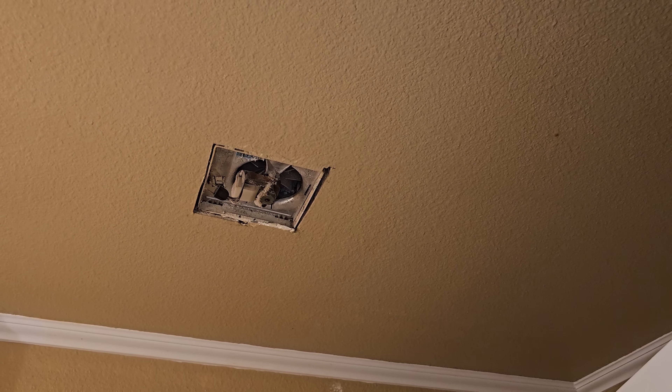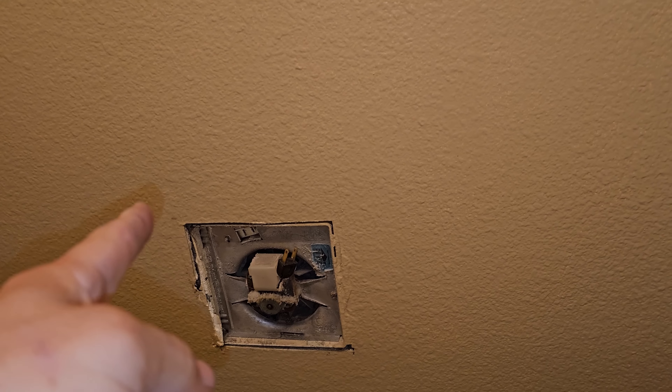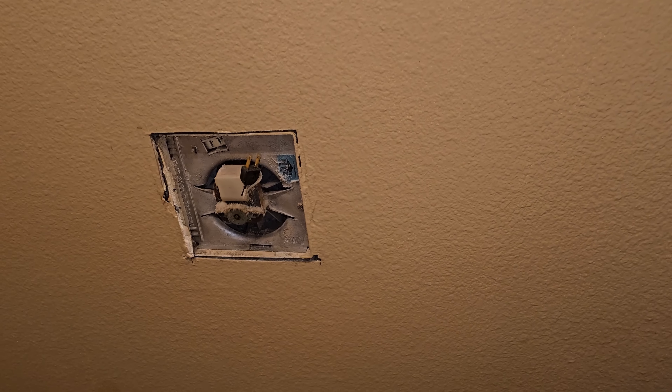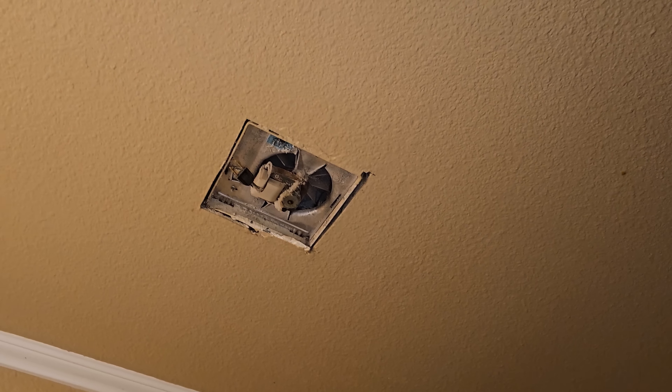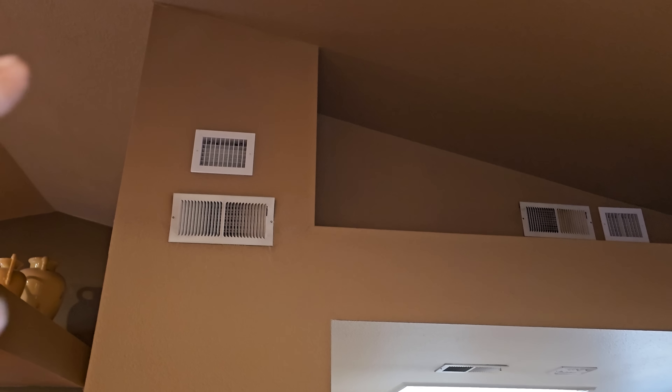Part of my project — we're putting in better bathroom fans, so I'm about to retrofit this one to the bigger fan that has a light and a built-in damper to help with air leakage. I've got to cut the hole nine and three-quarters by ten and a half — a couple of inches bigger on each side. My joist runs right here so I'm enlarging the hole this way and that way, offsetting it a little more over the shower. I made a giant mess in the bathroom but we have a working fan-light. One thing — I had a 3-inch duct coming off this fan and it's made for a 4-inch, so I'm going to upgrade that, which I think will quiet it down a little.